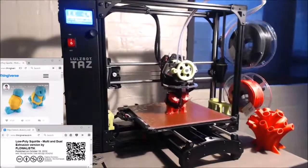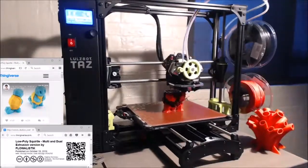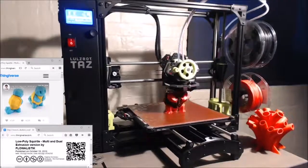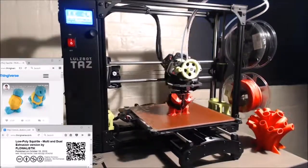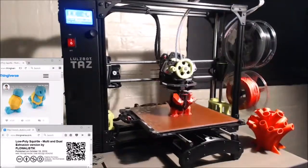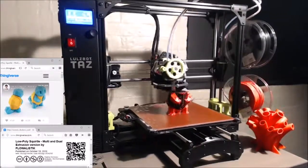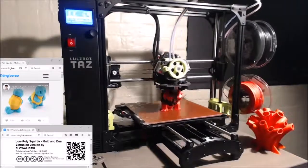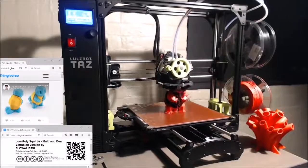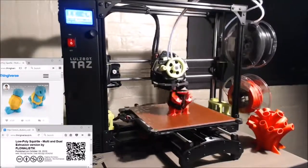You can definitely see that on the front of Squirtle here as he's printed. So how to resolve these dual extruder problems? One thing you can do is z-lift — whenever one of the print instructions is completed, you lift up by a pre-specified length. For these dual extrusions, I did one or two millimeters. It adds a lot of time to the print, but it really helps because when it's stopping and thinking about where to go next, it's not sitting there leaving ugly deposits of globs behind.